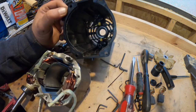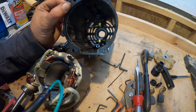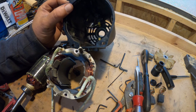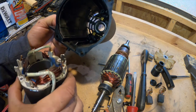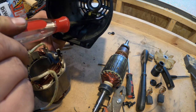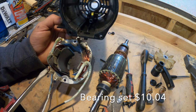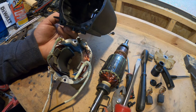The wires inside here are both black — one would go there and one would go there. For the power cable, the white connects here and the black connects over here. It's a good idea to take a picture of where everything goes to make sure you put it back together properly once you get the parts. The center piece is going to be a little fun to reconnect because there are connectors here, there, and there — and these wires aren't even long enough, so it's going to be interesting putting those back together.